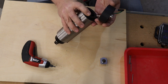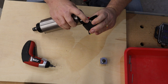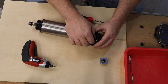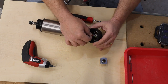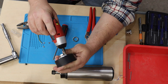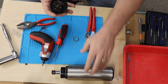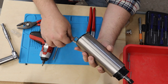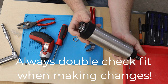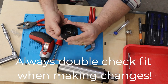It looks like I might have room, but this is going to be tight. The next step is I'm going to need to unsolder their connector from this thing and then just see if the new part will physically fit in there. The holes on this new plug didn't exactly line up with the preformed holes at the top of this, but I'm not going to worry about that until I can determine that this new plug assembly is not going to interfere with the fan of the spindle. I've got it fully inserted and I don't hear or feel any contact, so I'm going to assume we're okay.